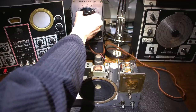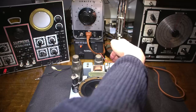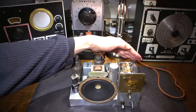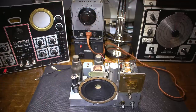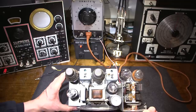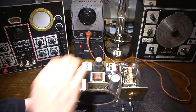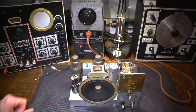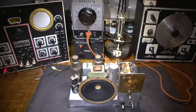Okay, bring it up to about 90 volts or so. Just keeping an eye on that rectifier tube there. So you can start to glow a little bit. Lots of light shining on it here, so it's kind of hard to see the filaments, at least in the camera anyways. Tip this forward just a bit. See the filaments starting to light up there just a little bit. Okay, and bring this up to 120. Everything looks like everything is happening just fine here.